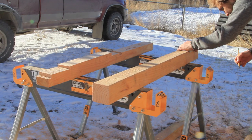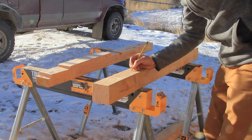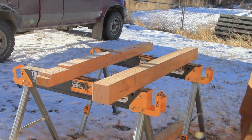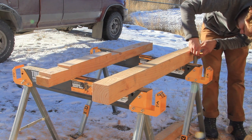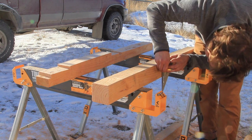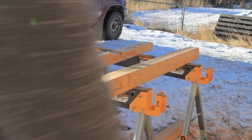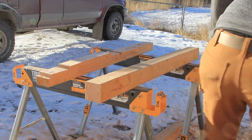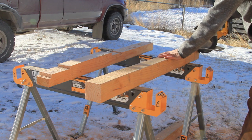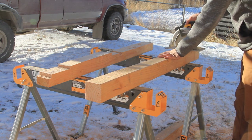So you can see here out on the workbenches, I am marking out the areas where I would need to do the different kerf cuts at different depths. The two different depths I'll be doing will be 3/4 inch and then 1.5 inches. The 3/4 inch will go for the baseboard and the main casing around the window, and then the apron will get a bit of a deeper kerf cut. It will be 1.5 inches.